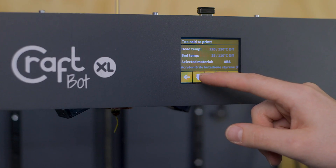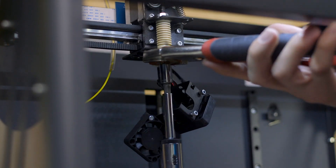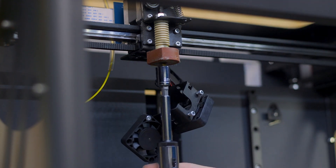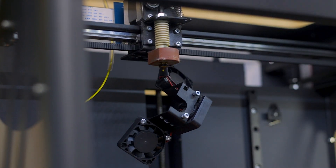The basics of it: heat up the hotend to loosen the filament from the nozzle, use channel lock pliers to hold the heater block, then use an appropriately sized wrench to unscrew the nozzle, and then reverse the steps with the new nozzle, without putting enough force on the nozzle to snap it off. Just one finger tight is enough.